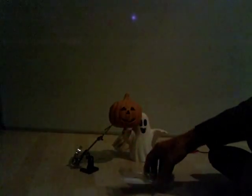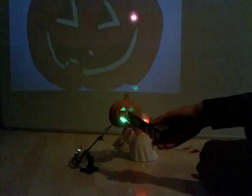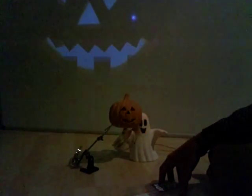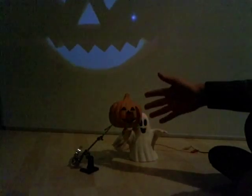did is I had these LED lights. There are 40 lights in there, and they are usually being powered with 3 AA batteries, but they don't need 4.5 volts, of course. And if you look inside it, you will see there's only one resistor, and the LEDs are being driven by the 4.5 volts minus the voltage over the resistor, meaning they're getting the full power.